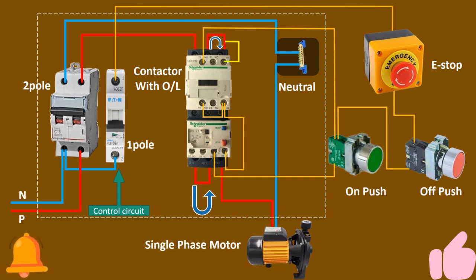Here we complete all the control circuit as well. When you push the ON button, the contactor will turn on and the power will move from the contactor to the motor. When anything happens, the motor will overload and the overload will trip. Hope you learned about this. If you like my video please subscribe, and your support means the world to us. Thanks, bye.